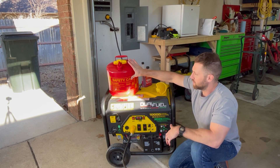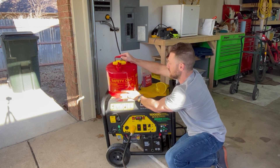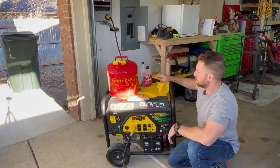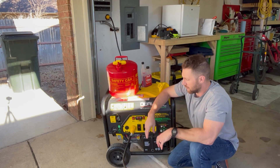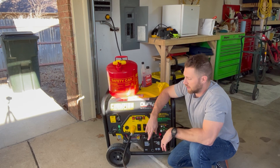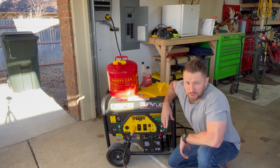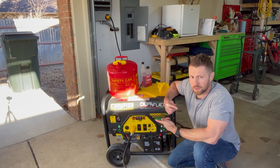A safety can is very important. This is a certified safety can — it doesn't leak when you tip it, nothing comes out, little vapors come out. You pull this back, the funnel sits on it, and you can fill this up. I have several of these that I keep handy in the shed. About every six months — sometimes every year if I'm lazy — I'll come out here, make sure this thing will start up, hook it up, and run the entire house for about an hour on the fuel that's inside, to cycle some fuel through it.